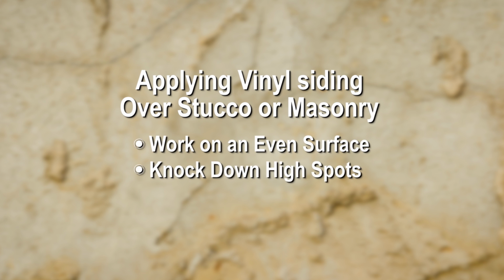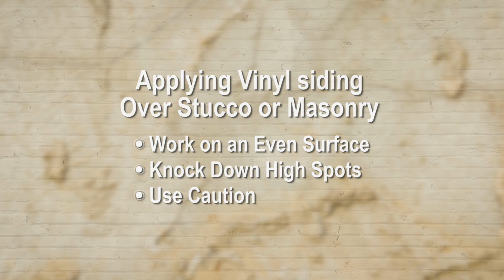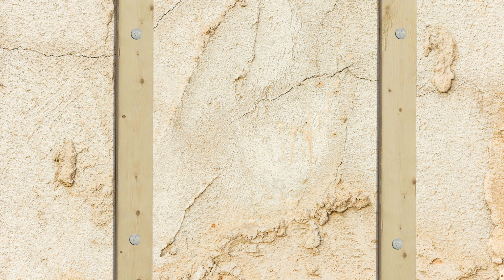When applying vinyl siding over stucco or masonry, you first have to be sure you're working on an even surface. To create that surface, you may have to knock down high spots where furring strips will be applied. Use caution when chipping off these spots. You don't want to crack or damage the remaining stucco or masonry. Apply 1 inch by 3 inch furring over the stucco or masonry using power-actuated fasteners or other appropriate masonry fasteners. Stucco will not hold fasteners tightly, so be sure nails or screws are anchored securely to studs.